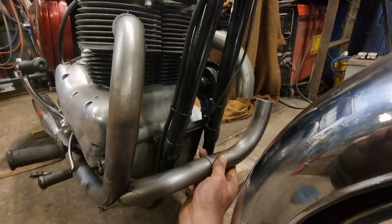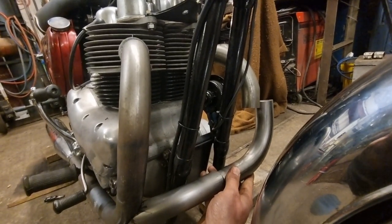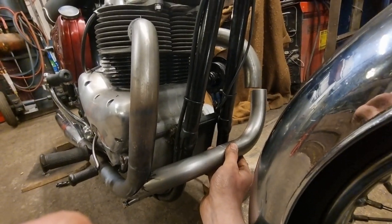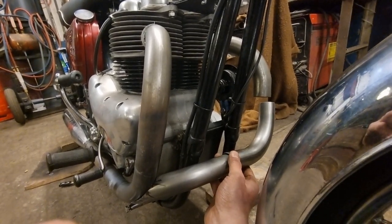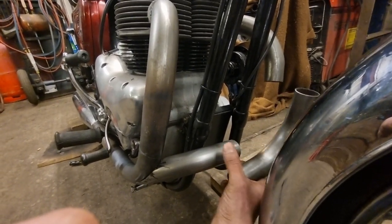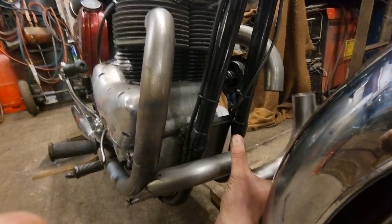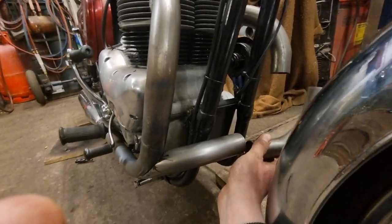So when I put that on there, it's sticking out a bit more than a pipe's width — there's a bit of a gap. That pipe's inch and five-eighths, so yeah, they want two inches chopping out roughly — an inch off this one, an inch off that one, and then I've got my join. I'll probably knock the two inches off this pipe, off the tailpipe, because this one's going to slot inside, and then the joining collar will be sat smack bang in the middle, which is where I want it to be.